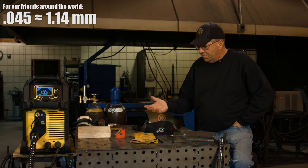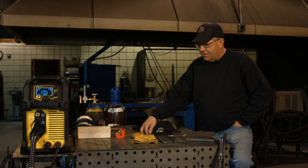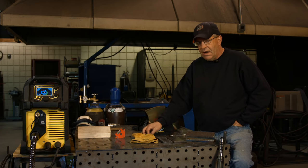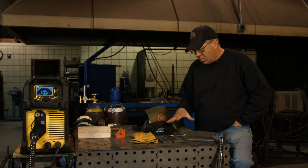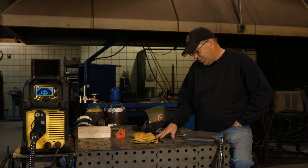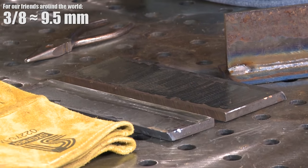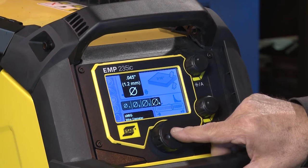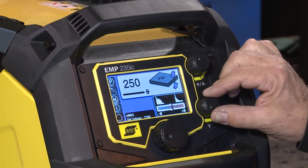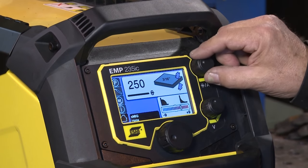What I want to do is hook up the 95/5 gas — I'll probably be running about 25 to 30 cubic feet per hour. I want a little bit more gas around this weld. I want to tack up some 3/8 plate and pull the trigger on S-MIG with it turned up all the way. The 250 inches a minute max is what it runs on. I'm curious to see what the machine will do and what the reaction is.